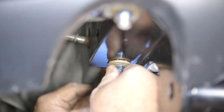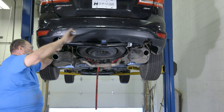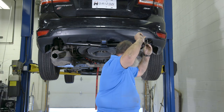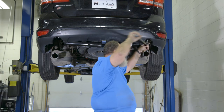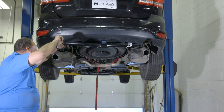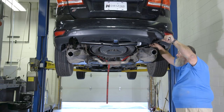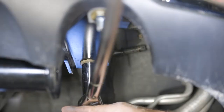After all of the hardware has been secured, use a torque wrench to tighten the nuts on the carriage bolts to 75 foot-pounds, and torque the bolts attached to the handle nuts to 50 foot-pounds. Be sure to hold the handle nuts in place to prevent them from rotating. You can bend them out of the way if needed.